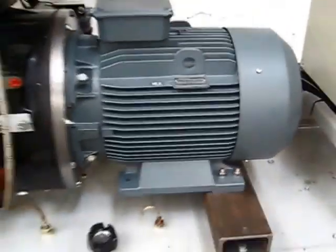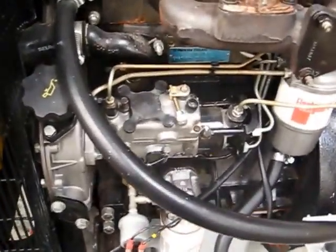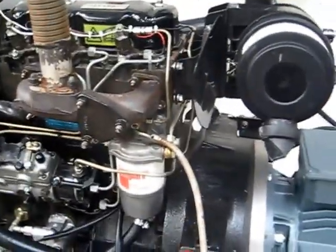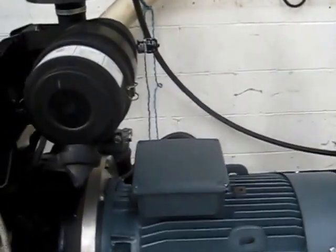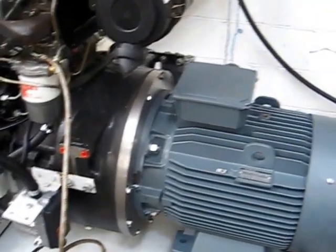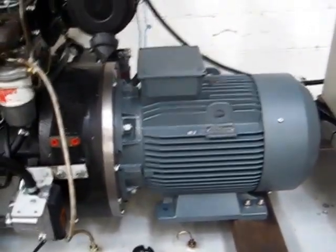This is not a new engine. It has a mechanical governor and runs at 1500 rpm controlled by that. This motor is a four-pole machine, which means its synchronous speed is also 1500 rpm. We did have to make sure that the wiring was correct to ensure that both the engine and the motor move in the same direction.